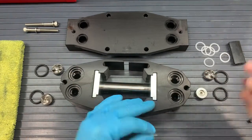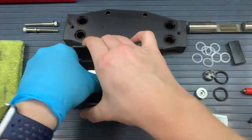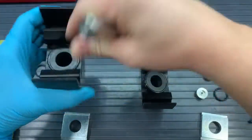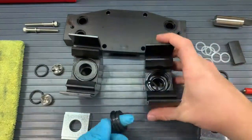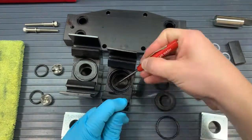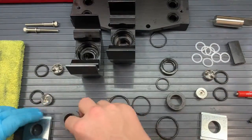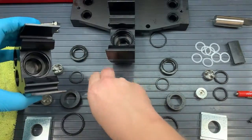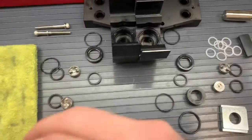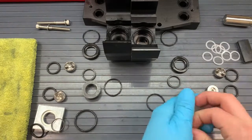Now that our valve ports are cleared, we can take our heads off of the plunger — it should just slide off relatively easily. The first thing that might pop off is the 124 O-rings. We will try to get our plunger guides off next. If they don't come off with your finger, just wiggle it back and forth in a circle and it should slowly come out. With that plunger guide there should be the O-24 O-rings around them. The next thing will be the support ring and U-cup — those should just pop out with your finger. The last thing in there should be a small O-ring, another O-24 O-ring. As you take out the retainer plate — the metal plate holding everything in — there should also be a seal ring and a 117 O-ring.